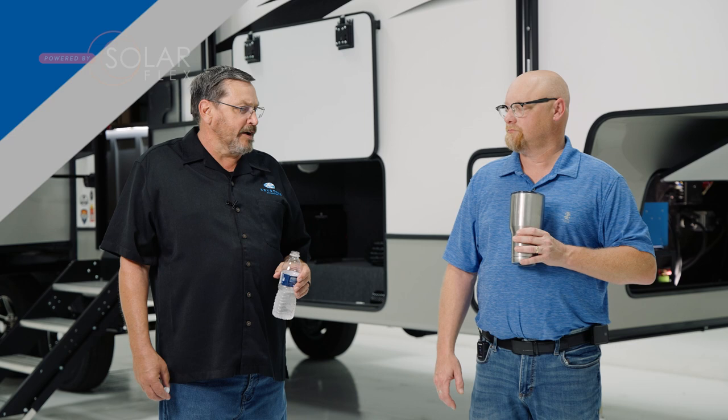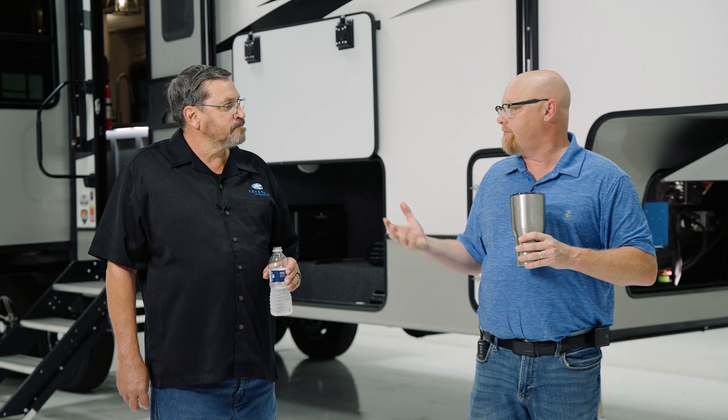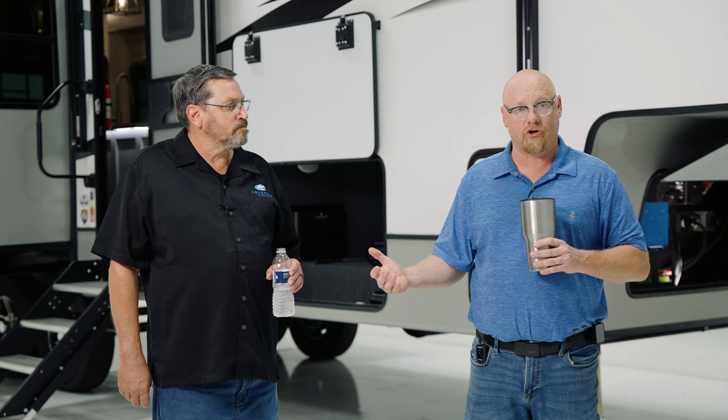Is there any consideration if it's cold when I'm camping, like I want to go on a ski trip? Sure. There's a lot of questionable information about lithium on the internet. These batteries have internal heat — there is a switch inside the coach for turning heat on. Lithium batteries will go ahead and discharge, meaning you can keep running things all the way down way below freezing and they'll keep running. What they won't do is they won't charge. If you're plugged into shore power and we're talking cold — the inside of that battery has got to get down below freezing — you'll need to turn on your battery heat, then they'll warm up, consume their own energy inside, and then allow the solar panels or shore power to charge. These units do have heated batteries and it's an internal heat source, which is an advantage compared to a lot of other stuff that's out there.